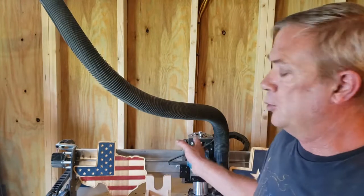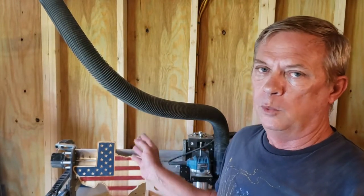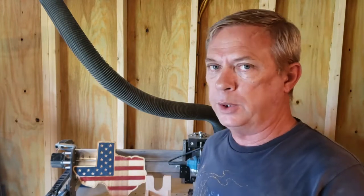If you're going to get a CNC of any kind, an uninterruptible power supply is probably a good idea. When this thing loses power, wherever it is when it comes back on will be machine zero. If you're in the middle of a job that takes hours and hours, that can be a real pain.